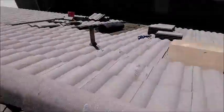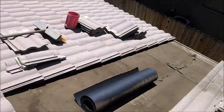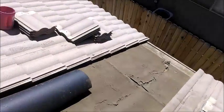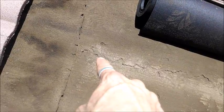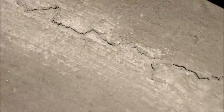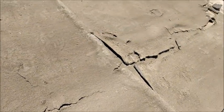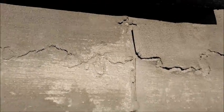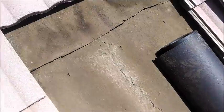There are actually two leaks on this roof that I am repairing. I've already repaired one and replaced all the felt paper. But you can see here where the leak entry point happened through the tile, and you can see that it has just obliterated the felt paper all the way down. This felt paper has to be replaced - there's no repairing it. I will need to put new blankets in here on every course of felt.